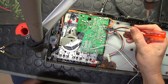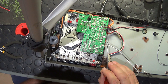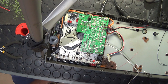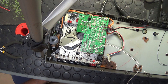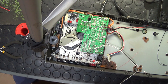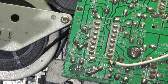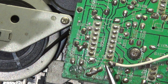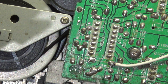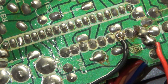You can see I've already soldered. First of all, I've soldered the earth or ground part of my audio signal to that pin over there — I'll zoom in just now — and I've taken the audio from this point over there. The white cable being the audio part, you'll see that I've soldered it here to that pin over there. That is on the same track from the audio chip at the back there.